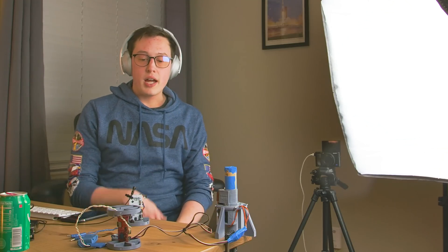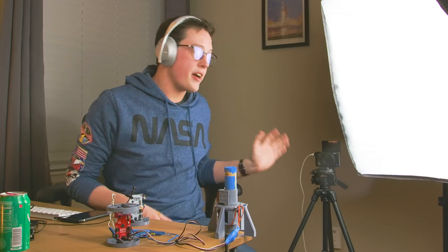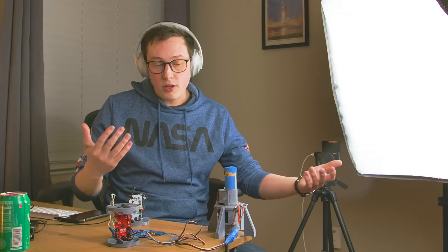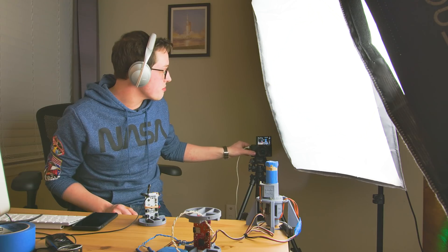I have headphones on because I'm listening to music because this type of testing is a little bit boring. I have a tiny little program that's running on the Signal computer, which when I turn it on, it waits for a little bit and then it actuates the mount to five degrees like that, and it turns on a little green light once it does. So on the high-speed camera, we'll see that green light turn on, which indicates exactly when we've started our signal and exactly when we sent that command. Then we can get a good characterization of what our performance looks like on these actuators. I've got plenty of light now — I've moved things a little bit closer, and it's time to start running some tests.